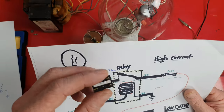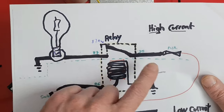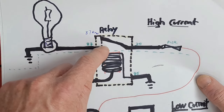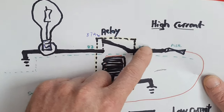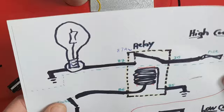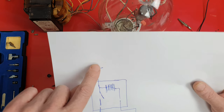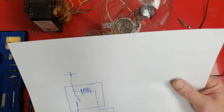When testing different size relays — some have four pins, some have three, some have five — a five-pin relay adds an 87a terminal, which is another leg on the open side of the switch. This lets you control two components with the same relay: when the switch is open, it supplies power through 87a; when closed, through 87. You test them the same way, just test the two switch legs individually. A three-pin relay does away with the extra power input — it just has power coming in to supply the coil, and when the coil is grounded it activates the switch.